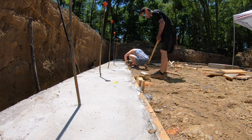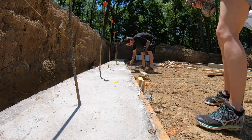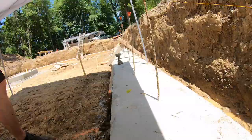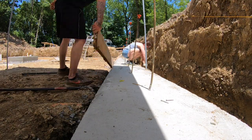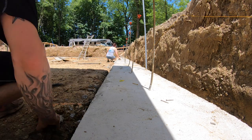That way, when it rains, if water gets down through the grating, it'll be very easy to flow all the way down through that round stone, make it into our French drain, which will then easily take it through our footer, bring it into our sump pump, and we'll be all set.